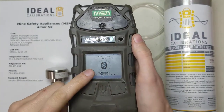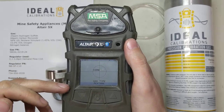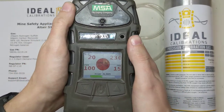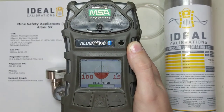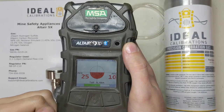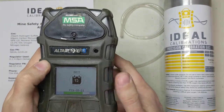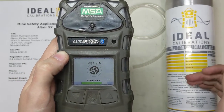It's going to go through startup and tell you some stuff about the monitor — the alarms, what sensors are installed, etc. This is a four gas plus chlorine unit, but one of my guys removed the chlorine sensor, so today we're just going through the four gas. It's a standard H2S, carbon monoxide, LEL, and oxygen unit. It's set up on the pentane curve, so it's not going to be reading on the methane curve. This unit uses a pentane curve and calibrates with pentane simulant, which I'll talk about when we get to the calibration gas.